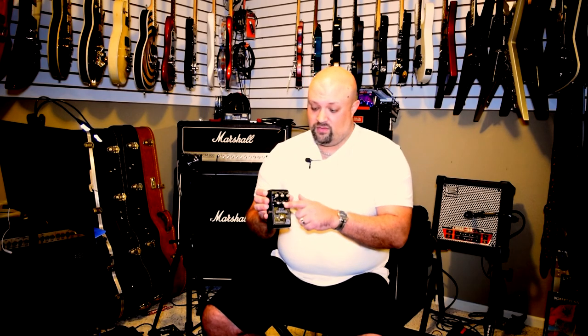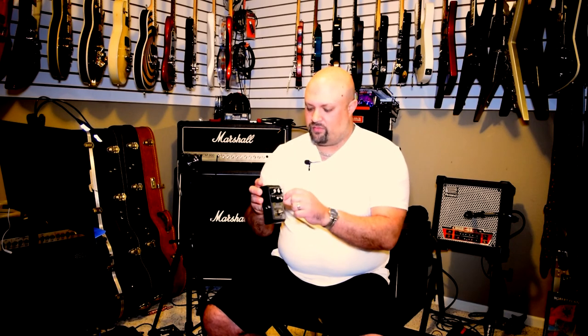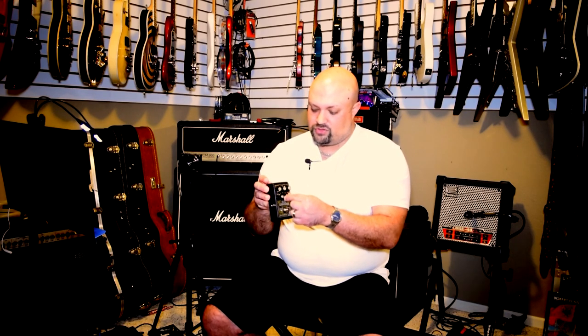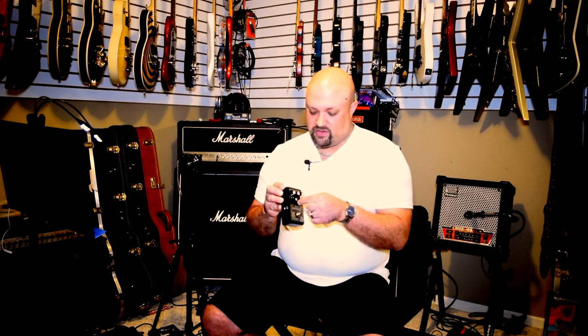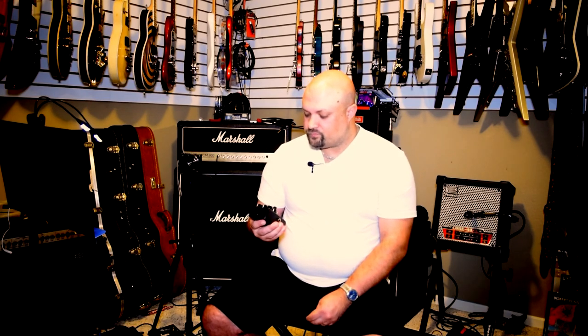And with this EQ design here, you can dial in just about any kind of EQ setting that you could think of. I found it was best to start with everything at 12 o'clock because with everything at 12 o'clock, that's designed to be flat, so you can either boost or cut whatever the selected frequency is on each of these. So I found it was best to start with everything at 12 o'clock, select the frequency that you want to work with, and then cut or boost it from there.